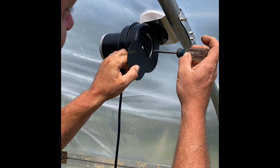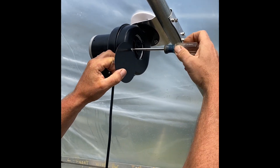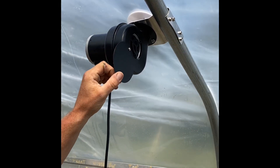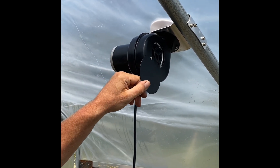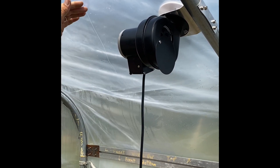The adjustment on this is a real crazy wild screw. That's where you go ahead and put inches of water column. I'll have to do a tap on this with a manometer, which is no big deal — I know how to do that.